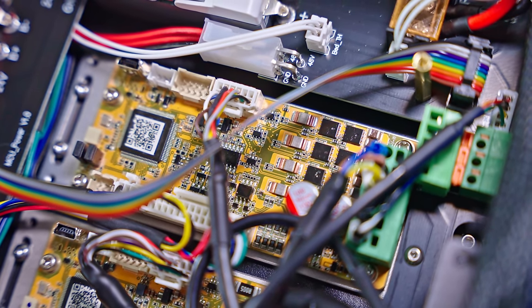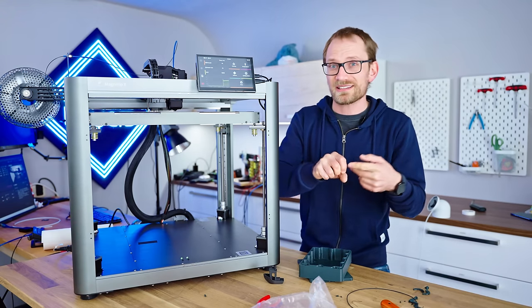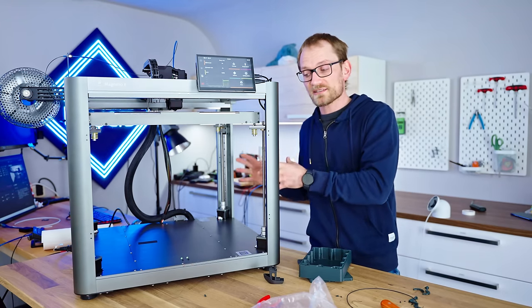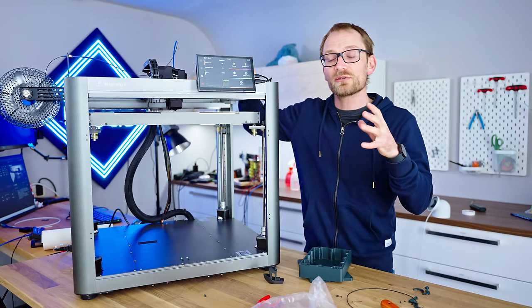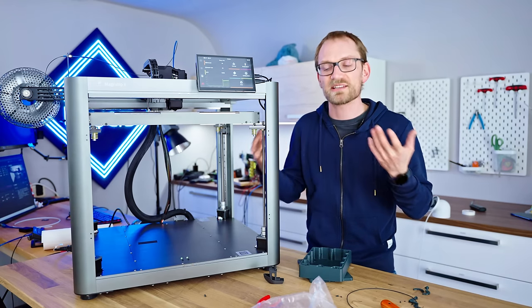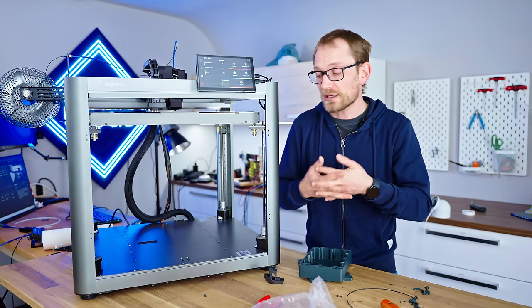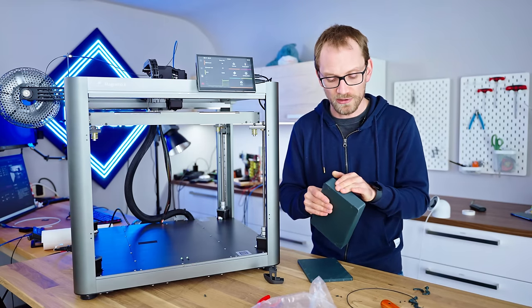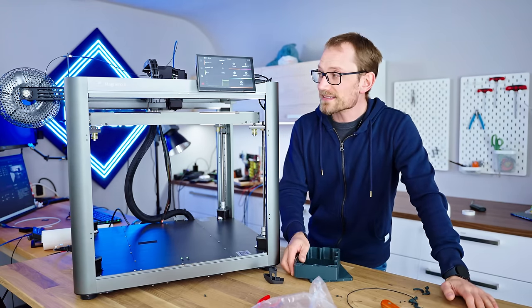Because now you have like three control loops running on top of each other. You've got the motion input itself with accelerations and that sort of thing. You've got input shaping, controlling before it gets sent to the drivers, and then the driver and their closed loop system trying to actually execute that in a way that is as true to the desired input as possible. So those three systems really need to work together to achieve a common goal, which is to produce a part that just looks good and has no artifacts or ripple like this. Again, that's something that really is down to software.